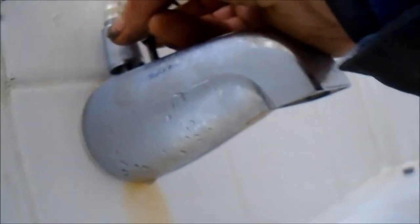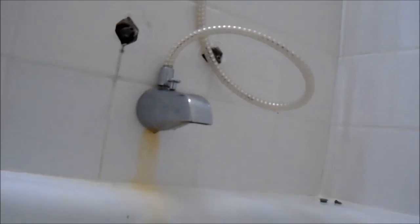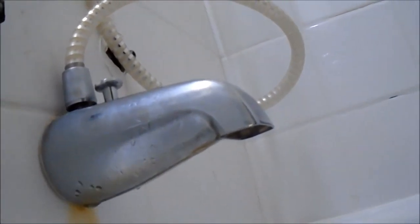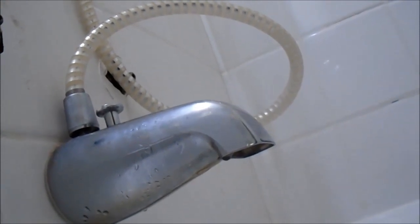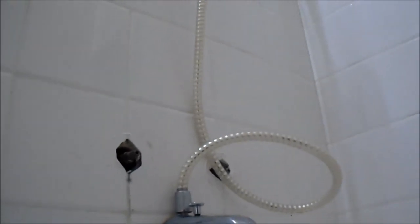It's not dripping very much at this point. Sometimes if you just hold that up and set that up, it'll fill that line up and that has a temporary effect. Another thing you can do - worst case scenario - you could pull that thing off and put a shut-off valve on it, basically like an outdoor water hose spigot. Look at how loose that is - that's probably why it's leaking down below. It's probably got a bad solder joint somewhere in one of those fittings.